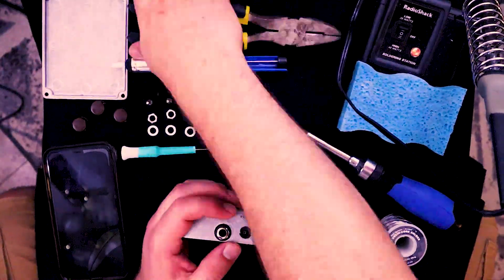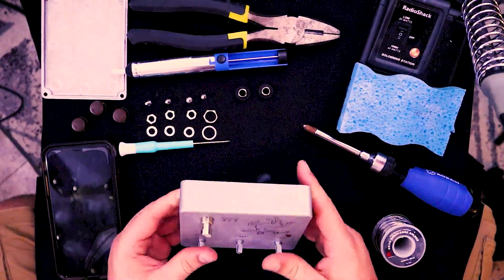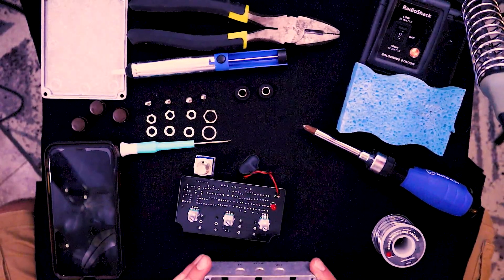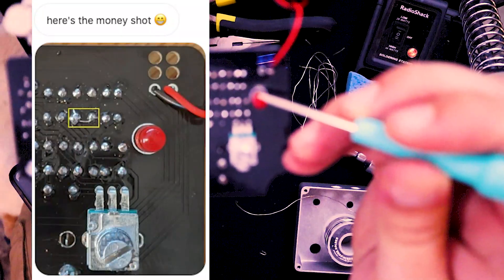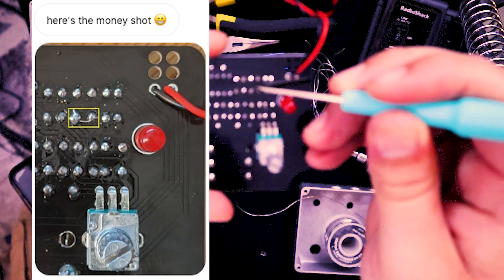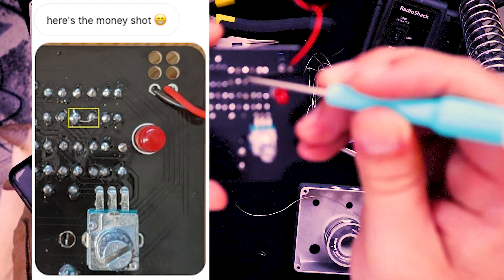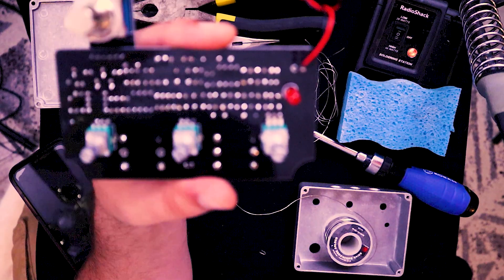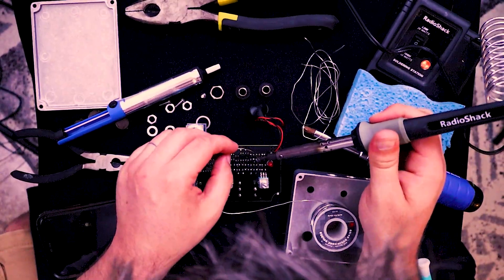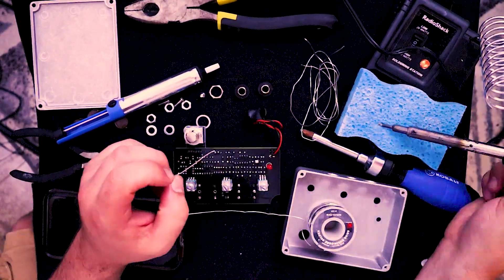Big note from Jonathan Wong: you may have to de-solder the foot switch connector to get to the other side of that PCB. Luckily for me, that wasn't the case. Once everything was unscrewed, including the foot switch, I was able to just pop it out by pushing on the knobs. You'll want to use the LED light as your North Star — go two over, one down, and it's pins three and four. These are the ones we are doing our solder on. I'm just doing a solder jumper. I originally tried to make a solder wire, but in reality it just turned into a big solder blob.